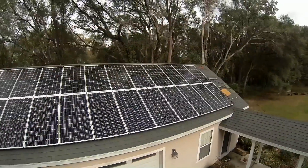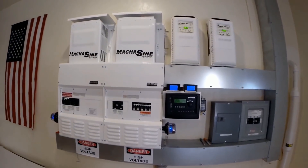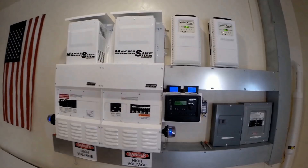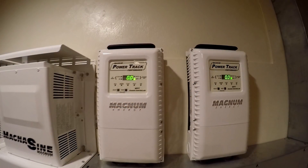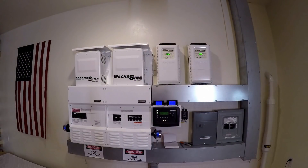Today I thought I would go over my complete parts list for my hybrid off-grid solar power system that I built a couple of years ago. It's 8,280 watts on the collector, about 8,800 watts on two inverters, double that peak, a 370 amp hour battery bank, and it produces about 25 kilowatt hours a day, although I run it almost up to 40 kilowatt hours a day. I put together this complete parts list so people who are trying to build the same thing have the entire list.